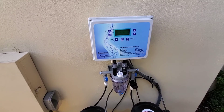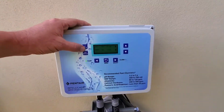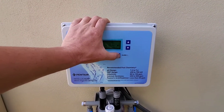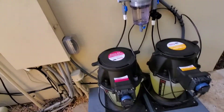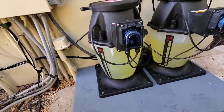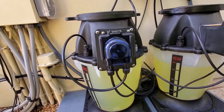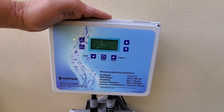This thing will run for about five minutes just to mix up the water and then it'll add some acid if needed. I'll do a test run and show you guys when it doses. I'll dose it manually just so you can see it. That's what it looks like when it's dosing — you can see this pump spinning, it's feeding some acid. I'm going to shut it off because we don't need much acid in there.